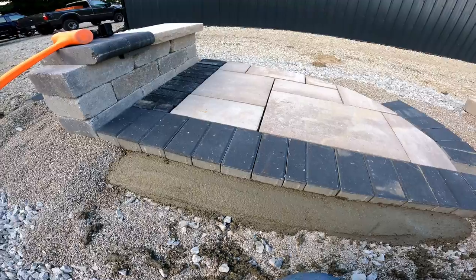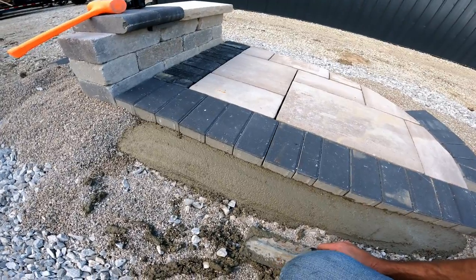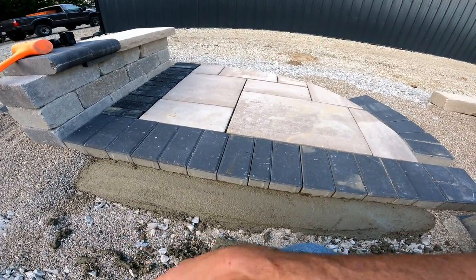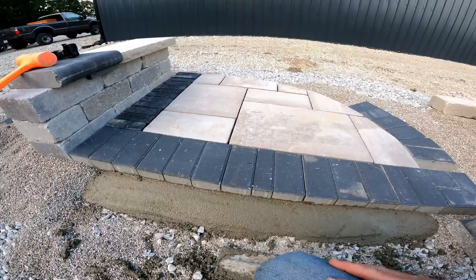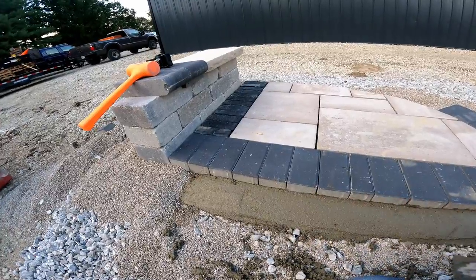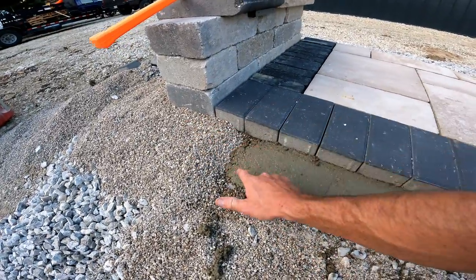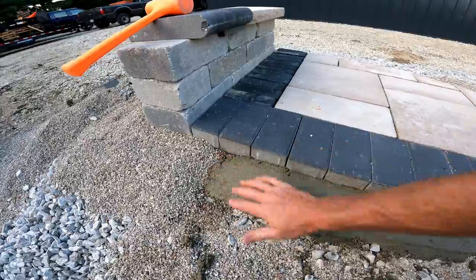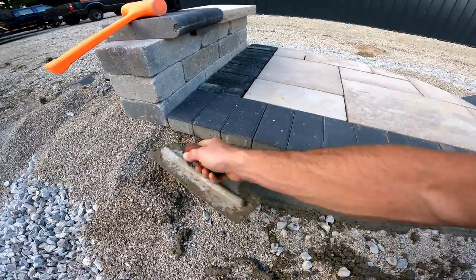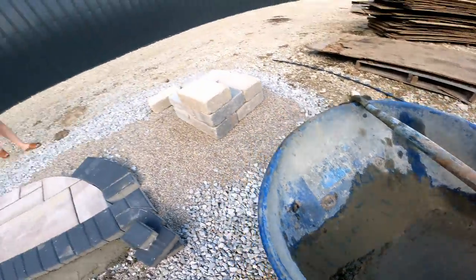There we go — and that's it. It doesn't need to be pretty; it's going to get buried anyway. It's got a little more moisture in it than I'd like, but one-handed, and it'll still be fine. We're going to let this set up for a couple of hours, do other things on site, then come back and run our compaction equipment through here for paver consolidation. Then we'll start backfilling soil over top. You can see those voids right there — we want to make sure we get concrete worked all the way down through there.